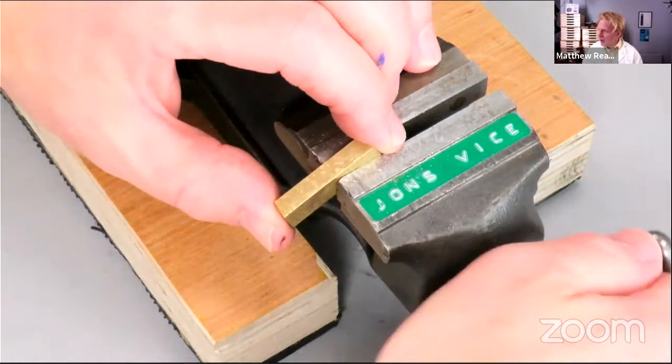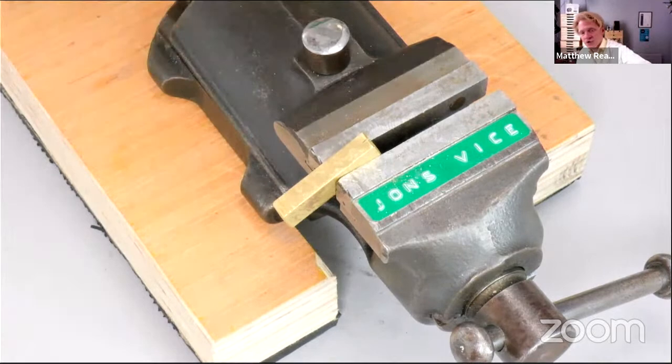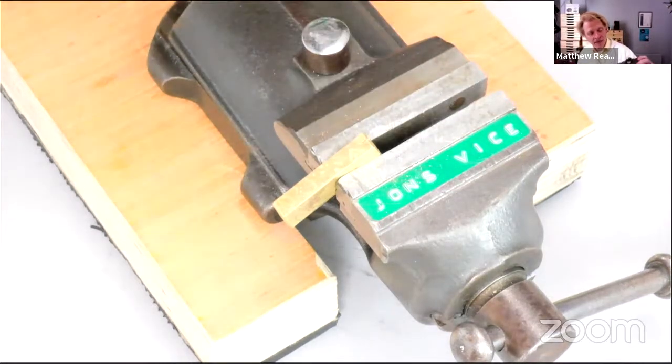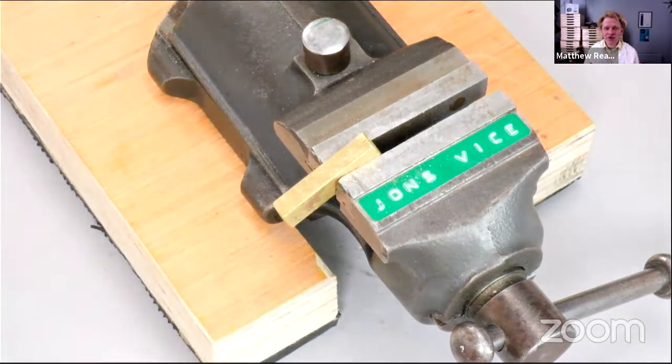Yeah, it's probably self-evident, but it was just one of those things that I always wondered when you see these back cocks and things, wherever it is. I mean, that one's pretty straight. How they got them so straight and so thin. And if you want to get it thinner, you might think, I want a slot that's thinner than my blade. Start with oversized material again. Get your slot made and then just forge it down on a piece of the material you want it to fit.